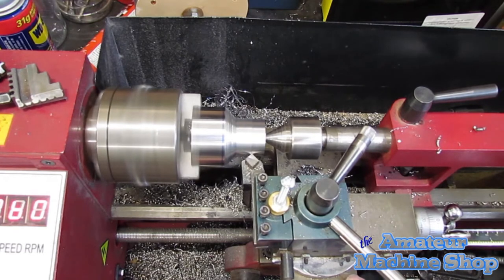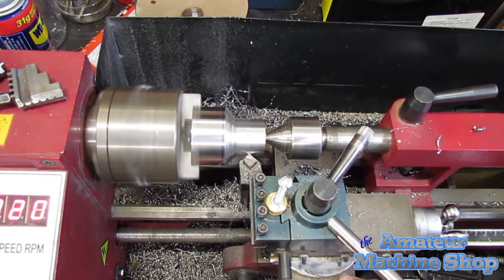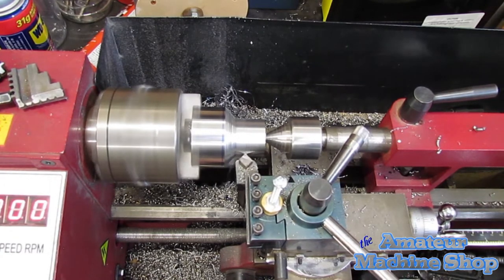While I was lathing, I thought I noticed the lathe carriage move up when I was taking a heavier cut. So with my hand, I pulled up on the carriage and, sure enough, the bit bites into the material. With mostly using the lathe for light work, I've never really noticed that the carriage had that much play. This is another issue that needs to be addressed.